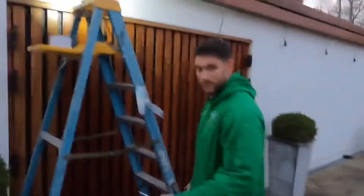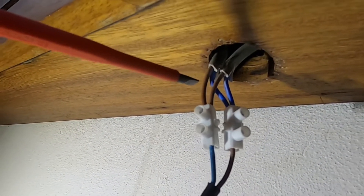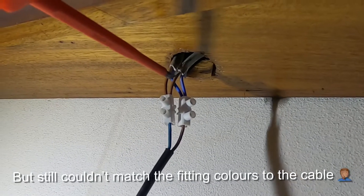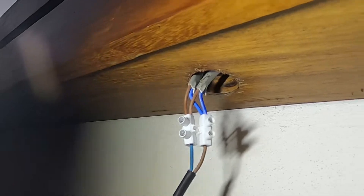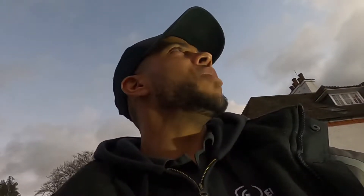All of those go in with the same colors, and then they've alternated the colors from this one light onwards. So where they had a brown and a blue cable in each terminal, they've almost wired them as parallel — but that means the positive conductor on one end is going into the negative on the other end. There's no real continuity here. That's obvious parallel wiring on one side and a sort of mixed-parallel on the other. My only conclusion is that someone has wired these not really knowing what they're doing.